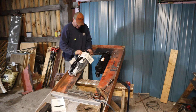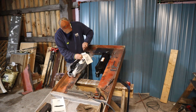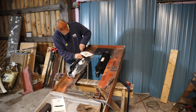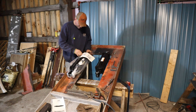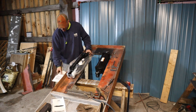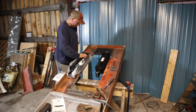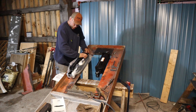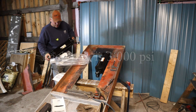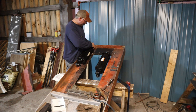Let's discuss these cylinders. These cylinders are 4-inch, rated for 3000 PSI. That matches up with our pump and the two-spool valve that we have coming. Both of these combined at 3000 PSI will be able to put out 37 tons of pressure on this center portion, which in all honesty is overkill.